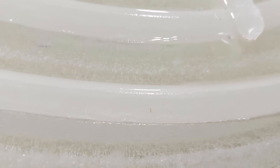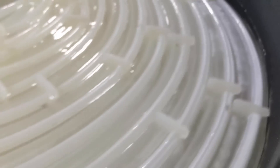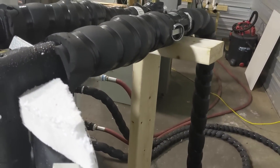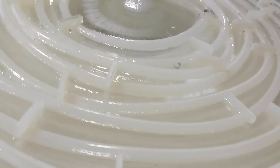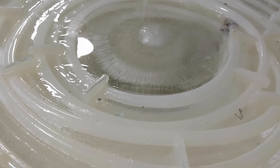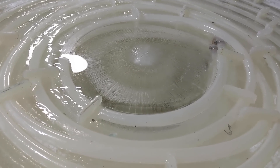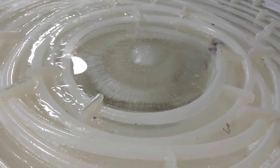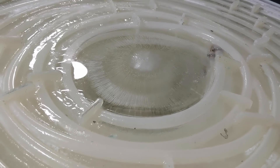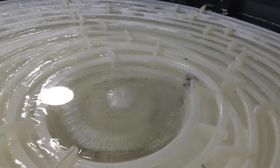There's a little air bubble — they don't have an air bleeder on this experiment right now, but an auto bleeder would fix that. You can see the air going through the PEX coils. From here, there are three-way mixing valves so you don't necessarily melt all the ice at once — you don't want 27-degree water in your air handlers. Mixing it with 50-degree exit water from the chiller gives your desired temperature at the fan coil, doing a slow melt to keep the thermal storage as long as possible and take the load off the compressor.